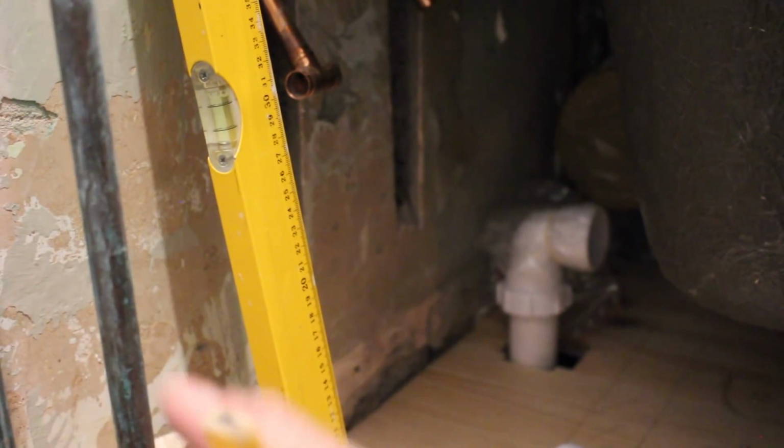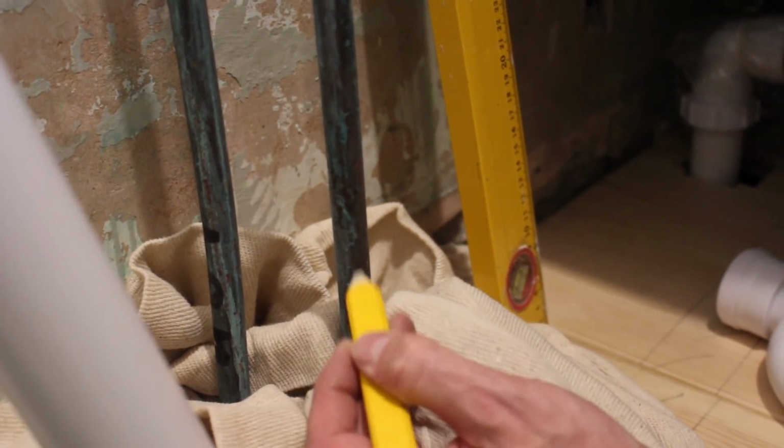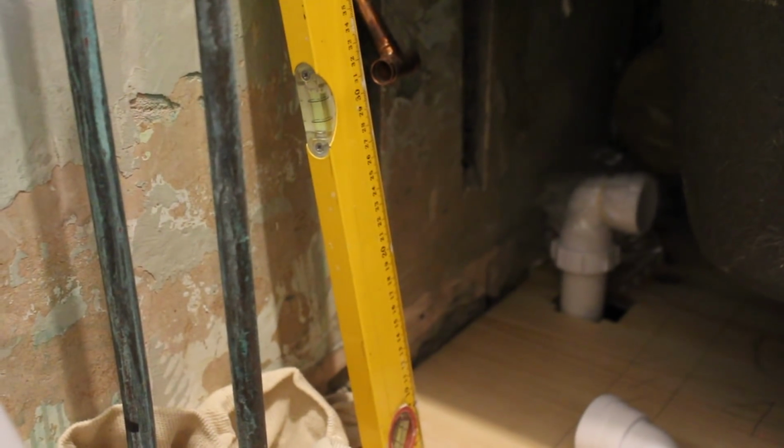As far as the toilet is concerned, this cold pipe can have a right angle as well. That can be on a compression. That can come over there like that, and then I can come up, have an isolating valve, and then that can feed somewhere up here, and that can be the cold feed for the toilet. And then obviously you've got the soil pipe that will come to here anyway, and that'll just naturally fit in, and that's it.